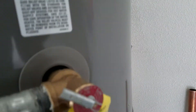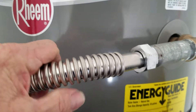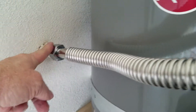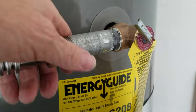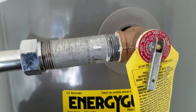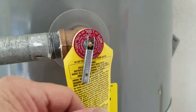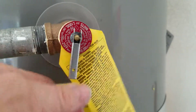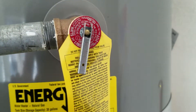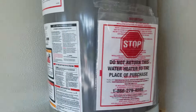The relief valve came with the water heater. It was installed pointing down, so we just turned it to the side and put a little nipple in there — this never holds water. Another Falcon stainless steel connector goes over to the existing point of connection; that's the discharge line in the wall. Technically you could pop this off once a year just to make sure it's working — it opens up and releases pressure and/or temperature in the tank; that's a safety feature. As it says in the book, pop it off once a year to make sure it opens and closes. If it gets stuck closed and you have too much temperature or pressure, this thing can launch into the air — I've never seen one actually do that except in training videos — but it is a safety feature.